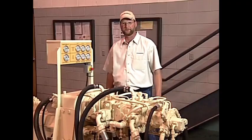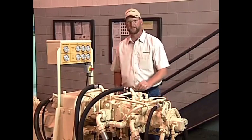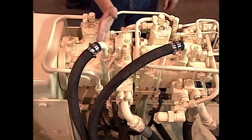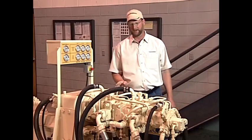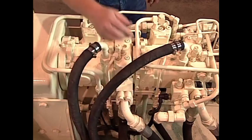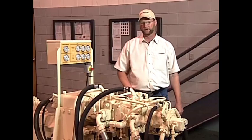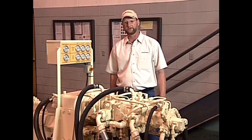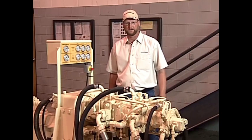This is the heart of our free flow pumping system. These two hydraulic pumps are two-direction variable displacement piston pumps. When we turn our concrete pump on, hydraulic oil flows from port A or port B, depending which stroke we're on. This helps the oil to flow directly from the hydraulic pump to the drive cylinders without any unnecessary valving or overheating of the oil.